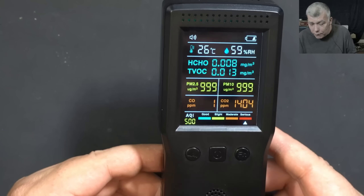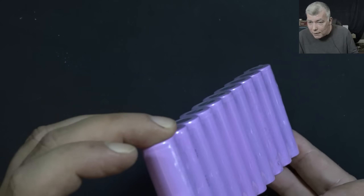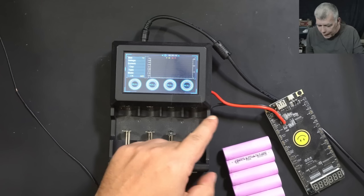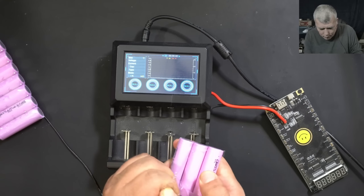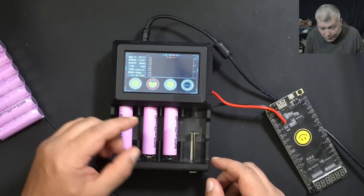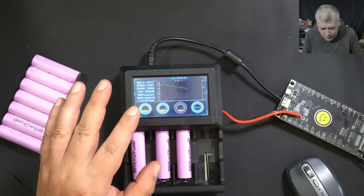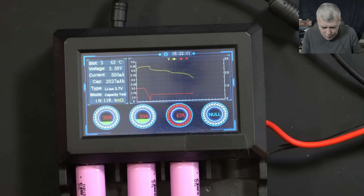Next in line are the lithium cells. I'm going to bring my battery analyzer to check the capacity — it should be 2.2 Ah, and that's what's important. You may remember my modified battery analyzer that can also test phone batteries. I'll test three cells. I'll start a capacity test on each battery — it will take probably a few hours. We're four hours later now and the discharge test is nearly at the end. Let me zoom the camera and explain what's going on.